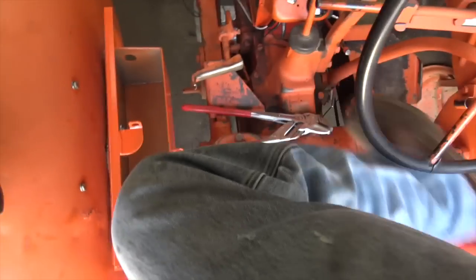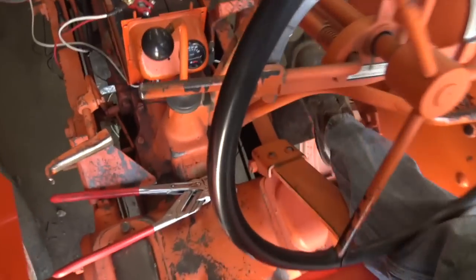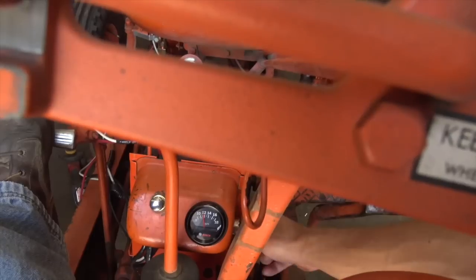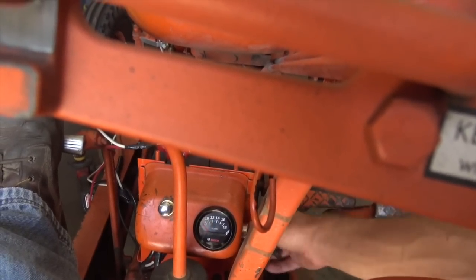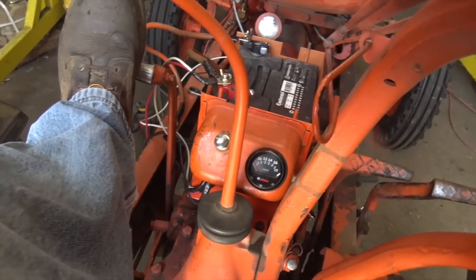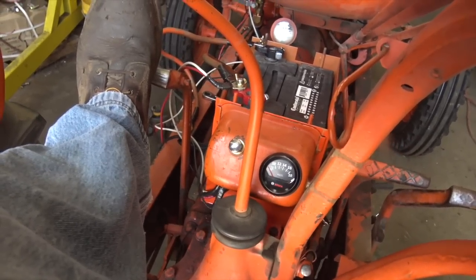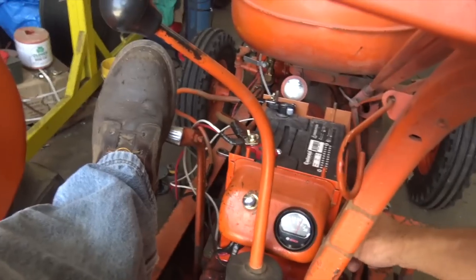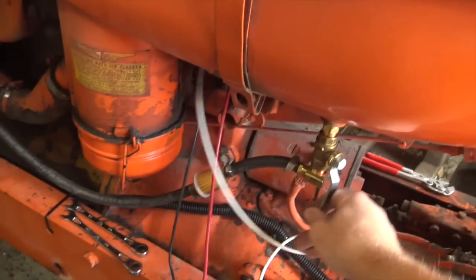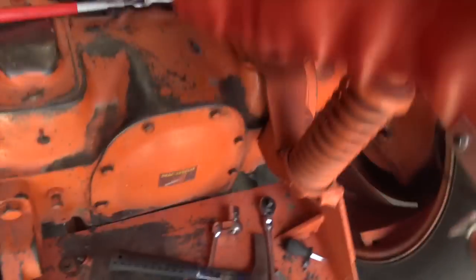This is what I like least about this tractor — simply climbing onto it. Alright, ignition. What in the world? There's nothing making it through. Solenoid. I think we just had a loose connection, but I guess there's one way to find out. How about that? I'll turn on the gas here, and if I can find out that this thing works, it'd be great, because then all we have to do is hide the wires and put the rest of the battery box together and clean some stuff up.